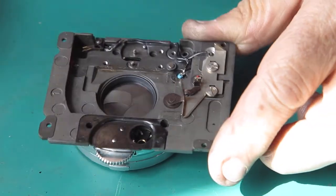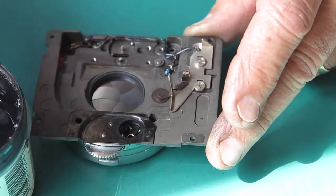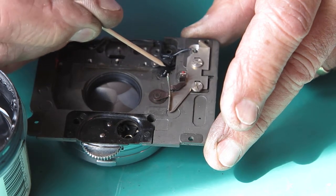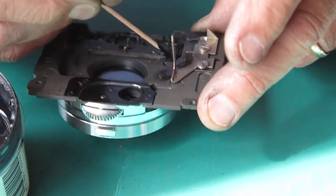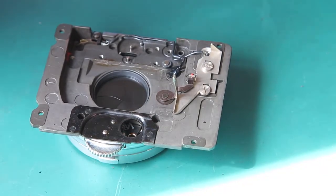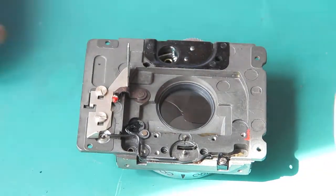As you can see, that's all soldered back well there. That went smoothly. No problems with solder spattering onto shutter blades or anything awful like that. I'm just going to apply a bit of black paint around here to cover over our freshly soldered terminal there, and it won't hurt to disguise that blue heat shrink at the same time. That paint will also glue that washer back in place so that shouldn't cause us any grief — not that it's inclined to wander anyway. That bit's nice and neat.